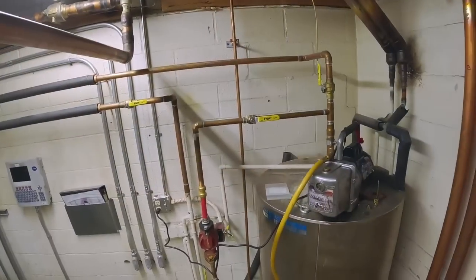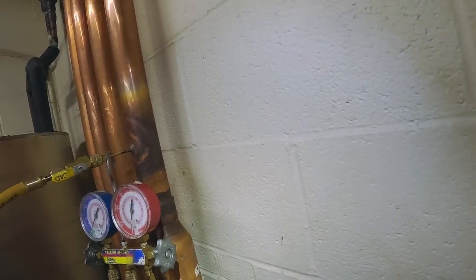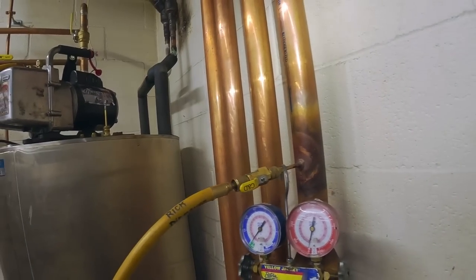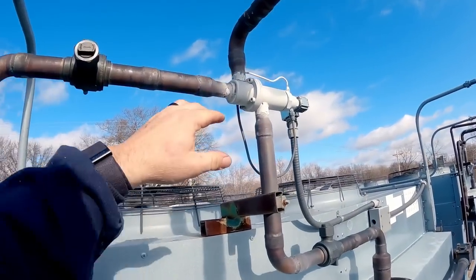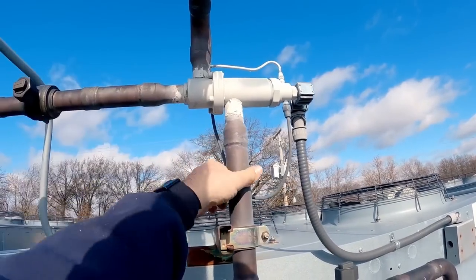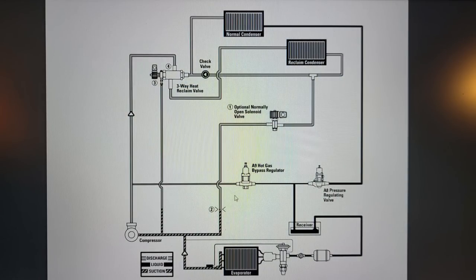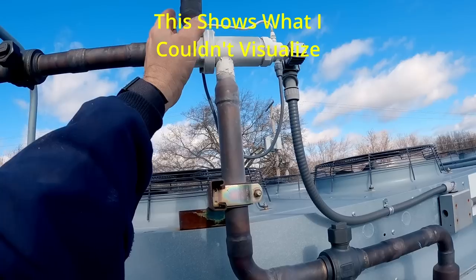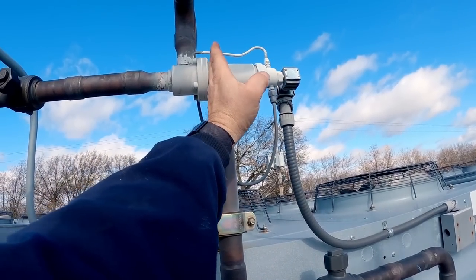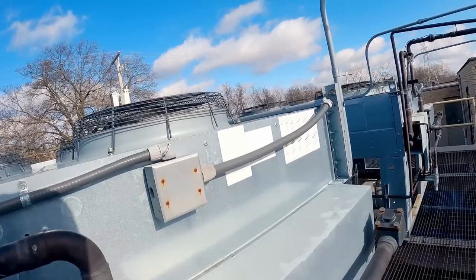That one turned quite a bit — might actually be better now. That one feels fairly tight. I'm not going to get wild with it. That check valve was kind of slamming shut when I had to open it up, which explains how it works. Refrigerant is going to come through — if it's forward it stops it, but it's pulled back and stopped there. If you go forward it lets it go through.